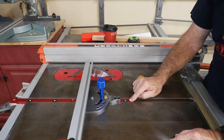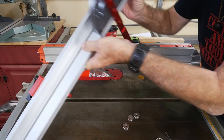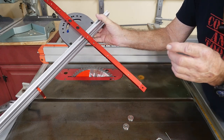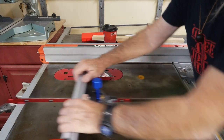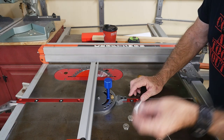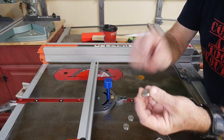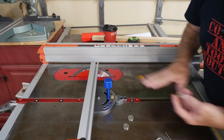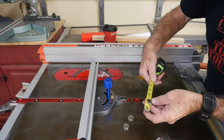If you did that, you'd want to have those wheels in here that I took off — let me show you the wheels. They came underneath and sit in these little slots, bolted in, and they helped follow the T-part of this track. But the problem is a lot of times I like to just put my wood in and start cutting. These are kind of a pain because it means I've got to take the miter all the way off the saw, guide it up through, and get it going. Also when I got them tight they were locking to the saw — you need probably just the thickness of a human hair to shim between them so it would fit properly. They actually do fit the slot part but they don't work otherwise.